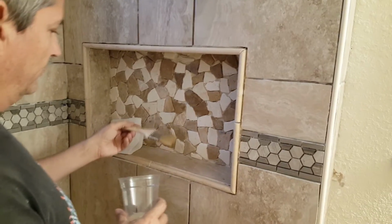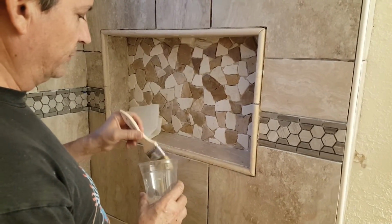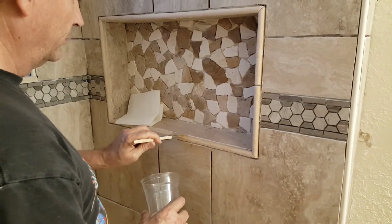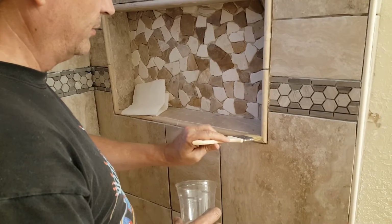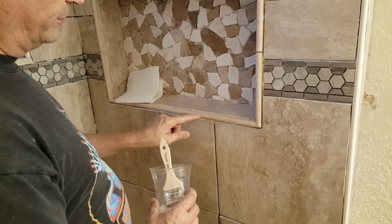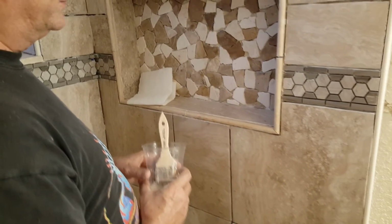And then down here on the pencil, I don't want to get any on the other tiles because those are ceramic. They don't need to get sealed. But you just drag it gently across. And you can see almost right away the effect of the enhancing part. See how these grain patterns here are really starting to become prominent. And that's all you do.